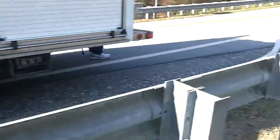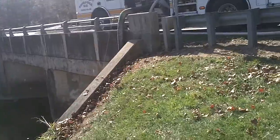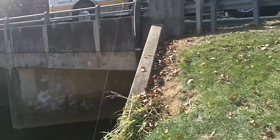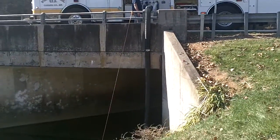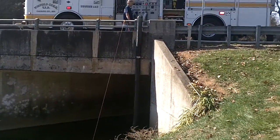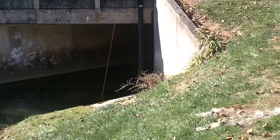A really good example of how the automatic air primer can work at a high lift. Consider doing this with a rotary vane primer and having to prime for a minute and a half or two minutes to get your water all the way up to the pumper — most likely you'd smell that primer smoking or burning and you'd see it smoking. From the perspective of this test, the high lift does not appear to be a problem for the Trident automatic air primer. We'll see you next time.